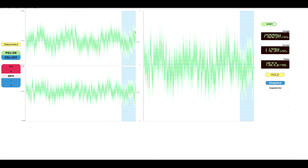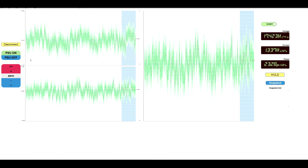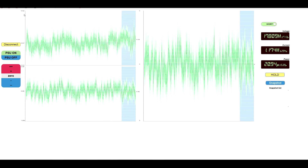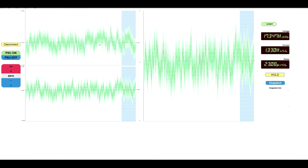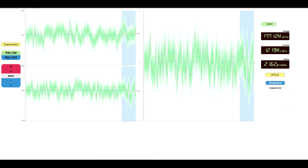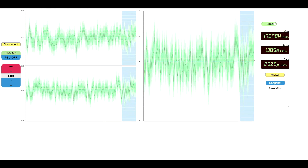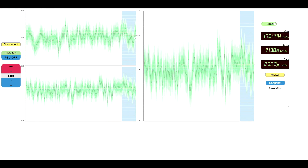So this is basically your measurement accuracy — you know with about 90% certainty that your value is going to be somewhere in that light green area. Just in case you think this measurement setup isn't very accurate, it is — it's just that we're very zoomed into these graphs. This voltage graph goes from 14 to 21 millivolts, and the actual standard deviation is only between 500 and 700 microvolts. So it's actually reasonably accurate, especially for such a fast conversion.